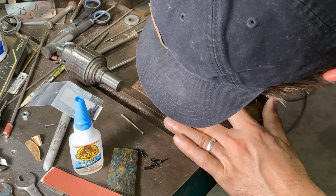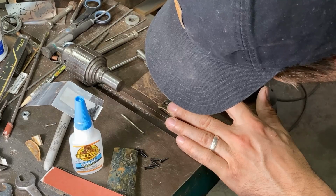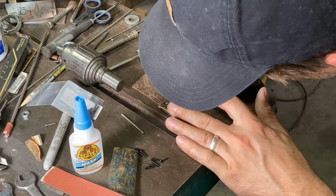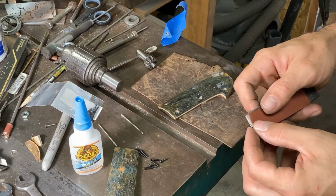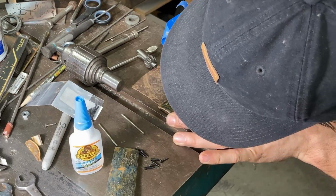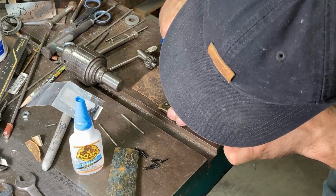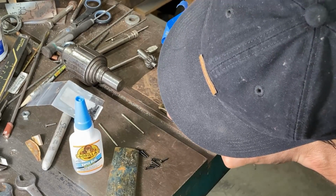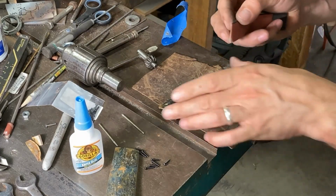If there's a chip here already, that means that unless we break the edge of it a little, it's liable to chip out more if we don't watch out. We don't want the ivory changing at all after we ship this knife out to our customer. We want it to be good and stay good. So to that end, anywhere it's chipped a little bit or might chip, or you're just going to smooth it up, make it look better and make it less likely to chip in the future. And now it'll take a good polish too if it's at 1000 grit. 1000 grit by hand, and then a buff, and boom, stuff just gets real nice and shiny.